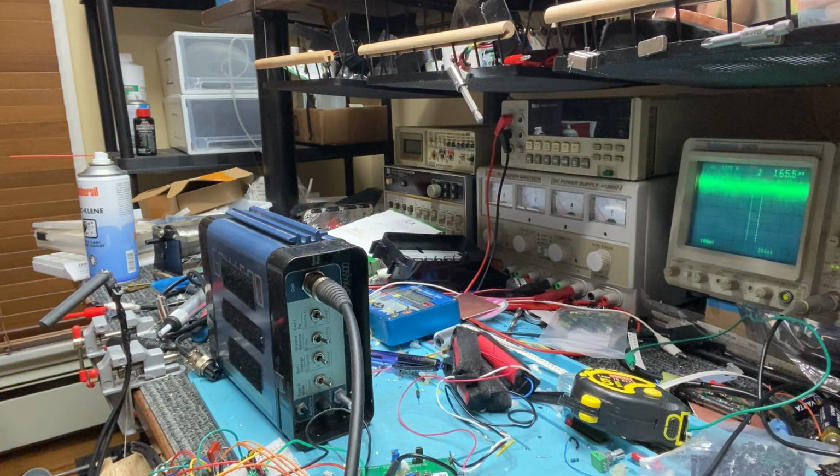They're an interesting thing, Hall effect devices. Have a read up on them and see how they work. They flick electrons to one side of a plate and then the other, depending on magnetic interaction. Also, some of them you can put very fast waveforms through, and they give you a fairly accurate representation of the waveform. I think a lot of the cheap ones clap out at about 50 kilohertz. Some of them are good to 100 kilohertz, and there are some very nice exotic ones out there which are pretty expensive, and they're good to a megahertz or so.